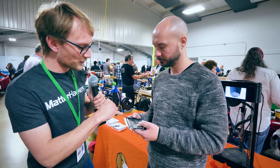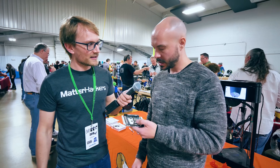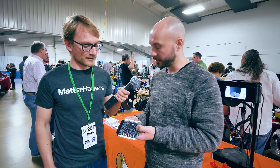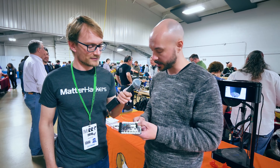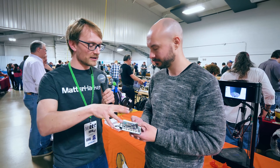It's got a nice powerful output stage with four output channels — three extruders plus a heated bed — with thermistor or thermocouple inputs, and you can choose that. End stops galore. So it's a quality board, all integrated.